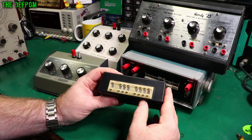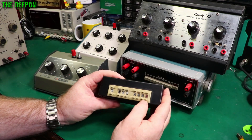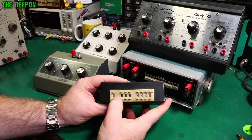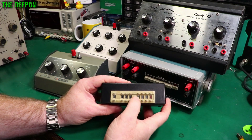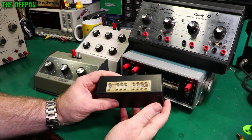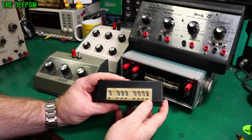This is a box I made myself. These are some switches I actually got from work because they were throwing them out, so that's quite handy. This will do up to basically 10 megaohms, then kilohms, then ohms, and that's milliohms — hundreds of milliohms. I built this myself. It's pretty easy — it's just a box with decade switches on it and you just switch in resistors which are fairly precision.